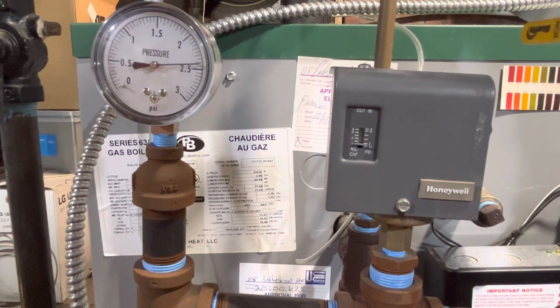As long as your main venting is as good as it needs to be and your radiator venting is fine, you can be okay oversized, but it is nice to keep the pressures lower. Everything's nicer with the pressure lower. You have fewer leaks of steam and water at the valves and stuff. All the valves last longer. All of the vents are going to last longer. There's just less pressure on them. Everything's quieter.